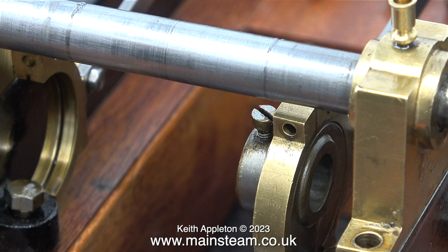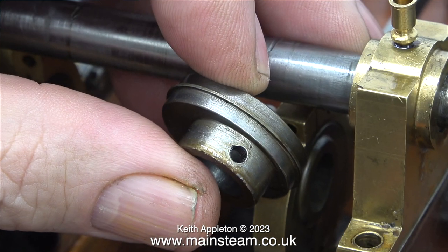What I am happy with, though, is the general condition of the machine parts, which is excellent. And the machined eccentric sheaves and matching straps are really machined well. The part that sticks up in the middle that locates the eccentric strap is very small, which leaves a really good bearing surface area for the eccentric strap on the sheave.